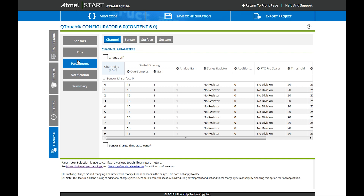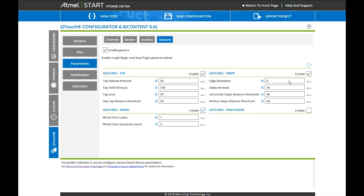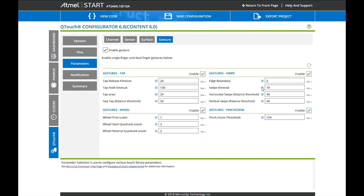On the parameter side for the touch sensors, we can leave everything to standard. The only thing I'd like to show you is that you are requested to tell the system what type of gestures you need for your use case. When you need tap gestures — tap or double tap — all these gestures will have a timeout, a precision, how big the tap area is, how a double tap needs to be performed, and so on. The more gestures you enable, the more detailed parameters you get. If they are unclear from naming, just go to the question marks and you get immediate help.